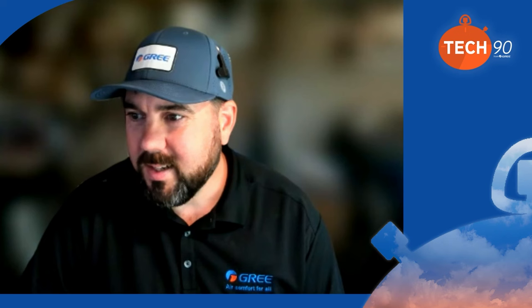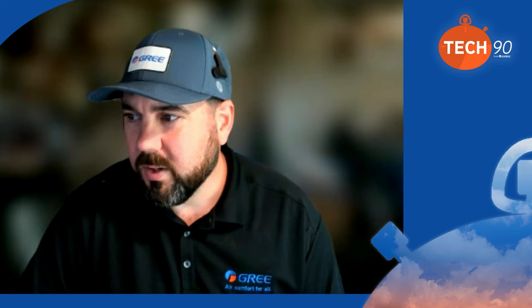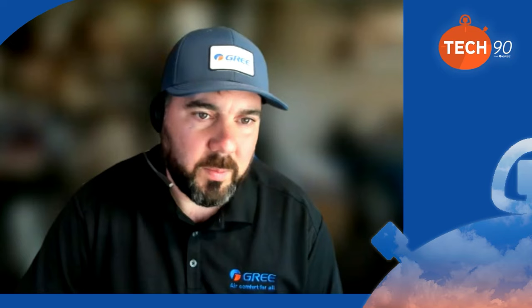Steven says, does GREE plan on making a 21 inch coil cabinet to fit the dual fuel application? Currently only 17 and 24 cabinets are available. I don't think there's any plans that we're aware of, Greg. There is no plans that I'm aware of. But the other thing, keep in mind, guys, you don't have to use a GREE coil in those situations. You can use another manufacturer's coil. Right. And a lot of those ratings are out there. Like some of them, we know we got some ratings with ADP. Yep. A few other rating matches. So, if you want to use a different manufacturer's coil so you can keep the same cabinet size, I can't discourage you from that at all.